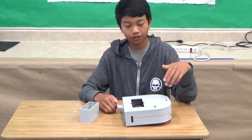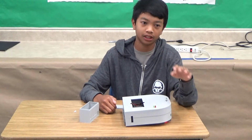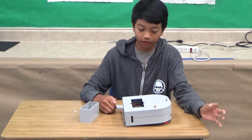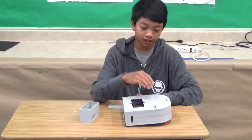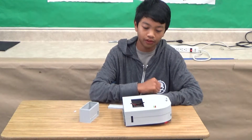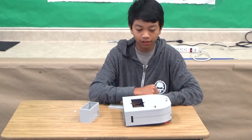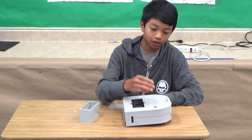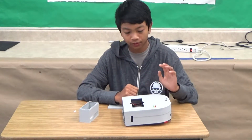which is basically telling the user that your battery is good. So I actually put the LED on function in the function where I set to turn the fan on. If it's false, meaning the battery is low according to my voltage divider, then it would start blinking again and turn the fan off. So that's for the status lights.